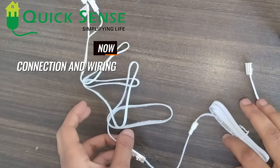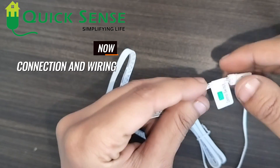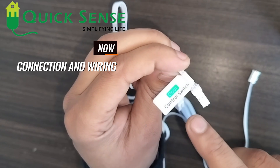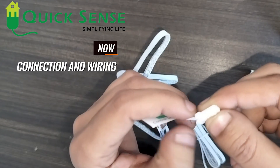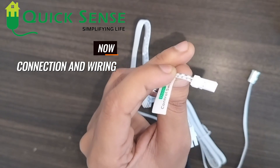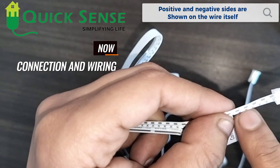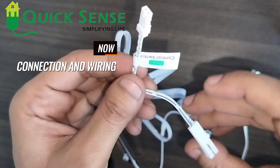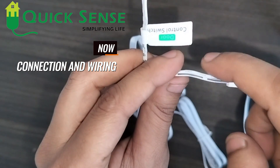On the second side, there are two wires. One is the door control switch — the stickered wire is the input side, and the door control switch is shown here. This is the input side of the sensor. The 12 volt DC supply is connected through this side, and the positive and negative terminals are clearly shown here.